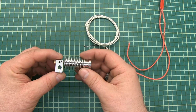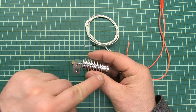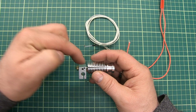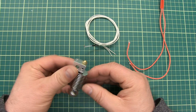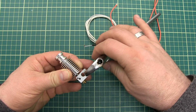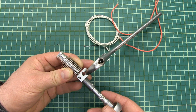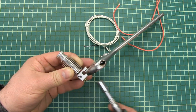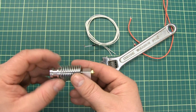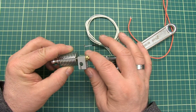When you're using this for the very first time, you have to make sure that the nozzle and the heat break — the small part inside here — are attached very firmly. Because you can't apply brute force to the heat break, you must do it the correct way: hold the heater block so it can't move, then use the correct tools on top of the nozzle and tighten it just a little. You do this at the maximum operating temperature. So if you're going to print at 240 degrees Celsius, heat the printer up to 240 degrees Celsius and then tighten it before letting filament run through.